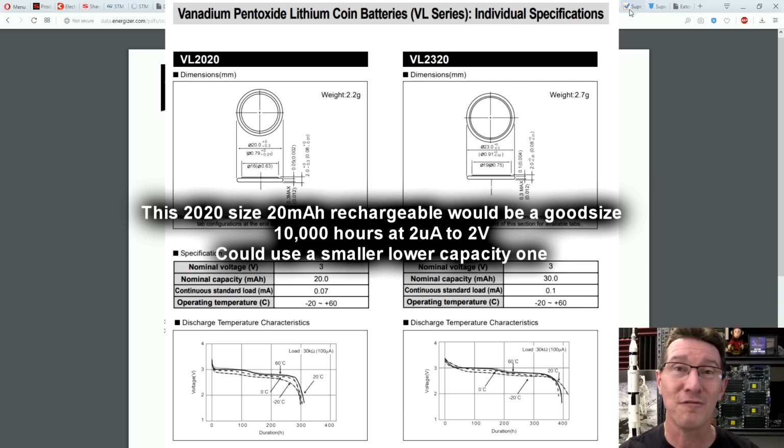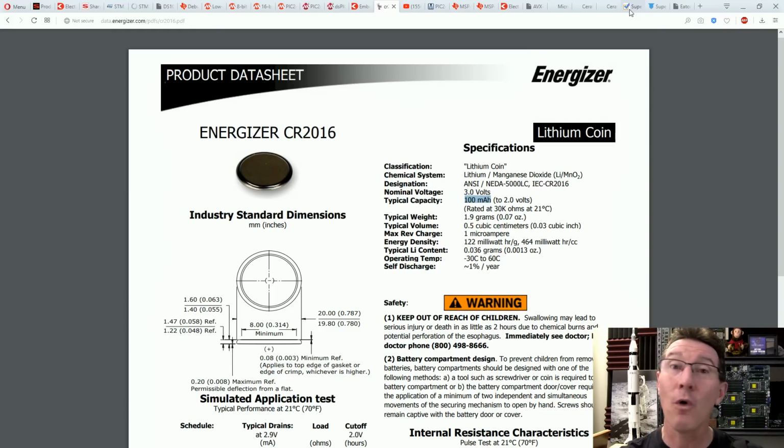Look, this is why I'm trying to avoid a battery solution altogether, a supercap solution altogether, and it's why I looked at the e-ink display originally, because it takes all this out of the equation. And if we could simply get an e-ink display this size with 7 segments, you don't need any backup solution at all, and it does exactly what I want, which is just leave the static image on the display. There's just no contest between the 2 solutions. You'd go e-ink every time if you could get it. Dicking around with supercaps and batteries and discharge curves and times and recharging schemes and back diodes to prevent this and that. Nah, come on.